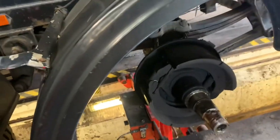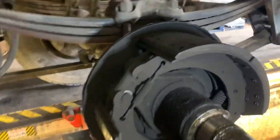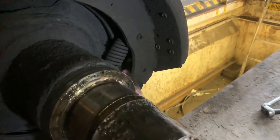I think I'm going to change the drums on this one. See them heat cracks, all in the drums. These are seven inch quick fits. They've got a retaining spring there and a seam on the other side, and a returning spring there. Can you see that?